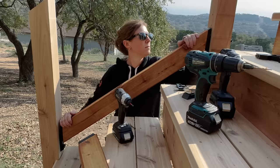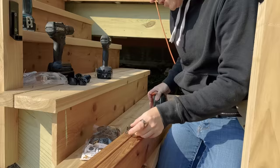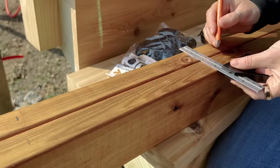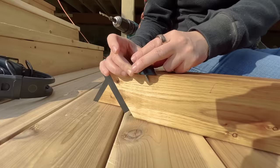Pop those into place, then mark off the baluster spacing. On the traditional railing that spacing is four inches and you can use the box as the layout, but whenever you're going at a diagonal we're actually going to move to five-and-a-half-inch spacing. I already found center of my board and I'm going to go two and three-quarter one way and two and three-quarter the other way. Something I like to do to make moving these locations quicker is use my combination square to transfer the location to the opposite rail.